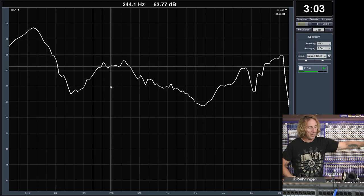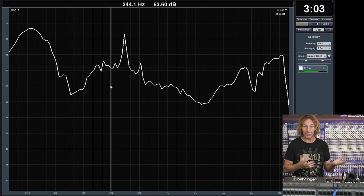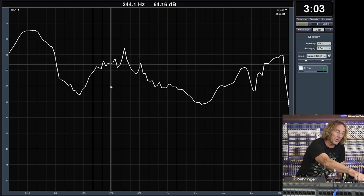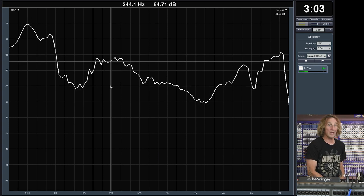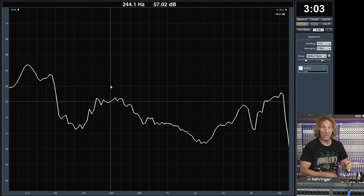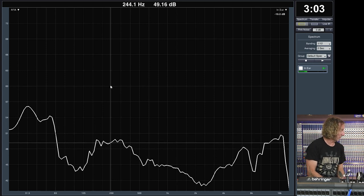Now, when we do comparisons either in this or other videos, what I've done is channel 1 and channel 2, if I hit the polarity reverse on one of the channels and we PFL both of them, we should have a null. And what I've done is I've nulled these two channels out such that they cancel really well. And we'll see this fall all the way to the ground.